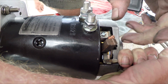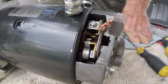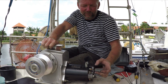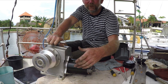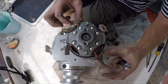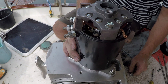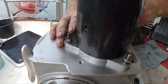You could use thin-nose pliers, but it's easy enough with your fingers - just release the spring back and the brush comes out. After having a look inside, it was pretty obvious that looking down at the commutator arm, it was very, very dirty. The brushes were pretty solid and weren't worn down completely, so that wasn't the problem. We decided to take the motor off to get access to the commutator arm and clean the inside. I removed all four brushes - they're all very similar and none completely worn down, but there's lots of dirt in there.